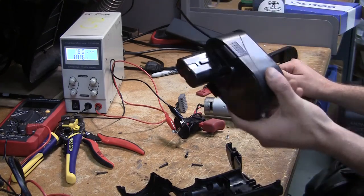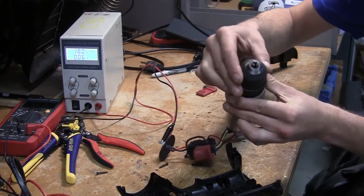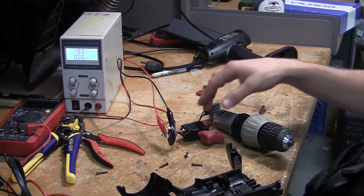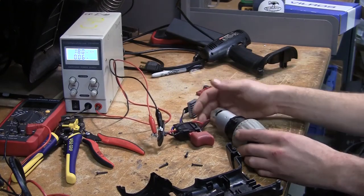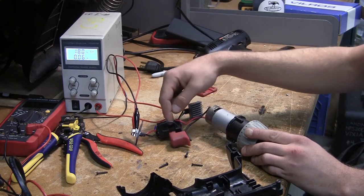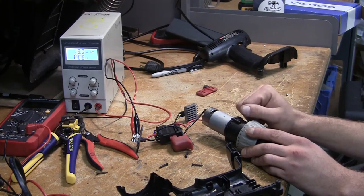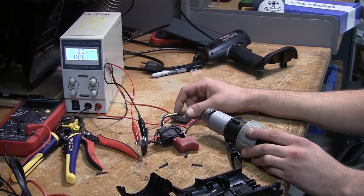What was wrong with this piece was probably just the battery. I also noticed that this chuck has a little bit of wobble, so that might have also been one of the reasons someone threw it away. You don't need to go any further with this circuit in terms of salvageability — there are many things you could make with just this trigger switch and motor. But if the motor controller didn't work, you could cut the black and red wires going from the motor to the motor controller, test them directly with the power supply, and deduce that the motor is fine but the controller is broken. The other thing you could salvage is the power MOSFET — if everything else is broken, you could use it to switch a motor on and off with your own motor controller.